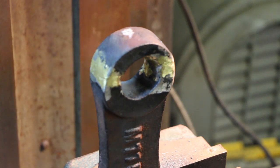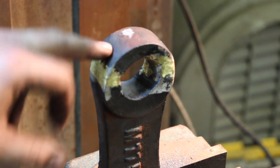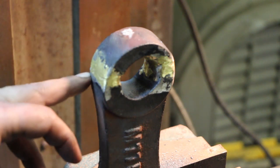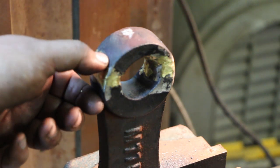We've got this set up on the vertical mill now. I'm going to come in here with the center drill, center drill two holes, drill those out, tap them, countersink them, and then put two screws in.